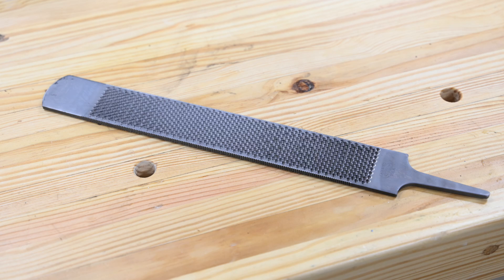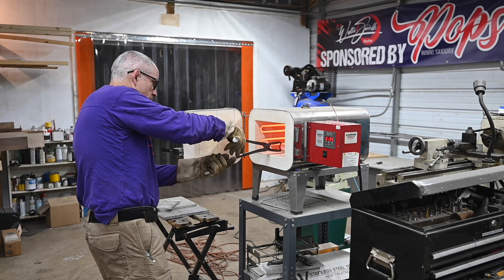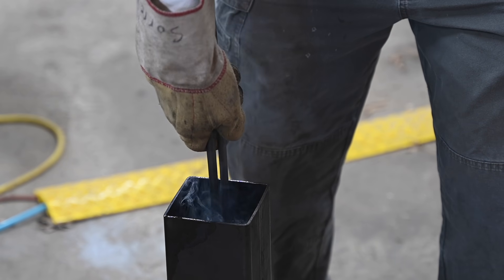Technically, this file is what we in the knife biz call a mystery steel — it's a proprietary steel specifically used by this manufacturer of rasps. There are literally thousands of different kinds of steel with different proportions of carbon, iron, and other alloying elements like chromium, manganese, vanadium, and all these things — each affecting how the heat treating works. In truth, we know that the vast majority of files are made from some variant of a high carbon steel known as 1095, so we'll treat it as if that's what it is. If you have a forge, you'll want to heat it just past non-magnetic, hold it there for a bit, and quench in a fast quenching oil like Parks 50.